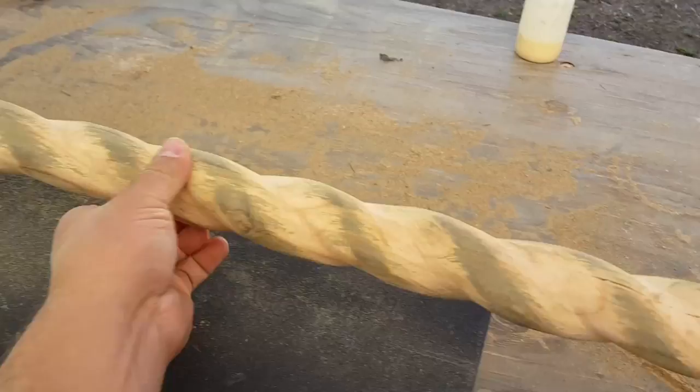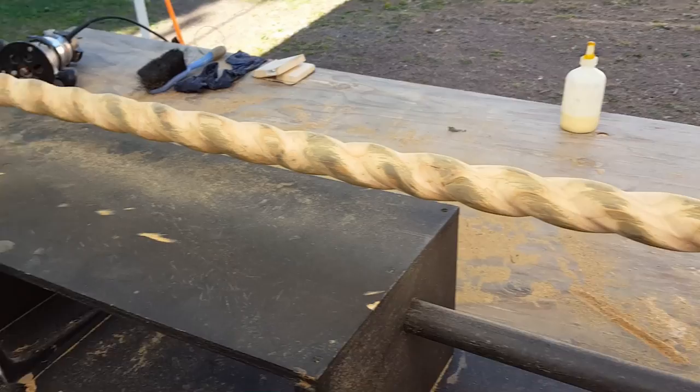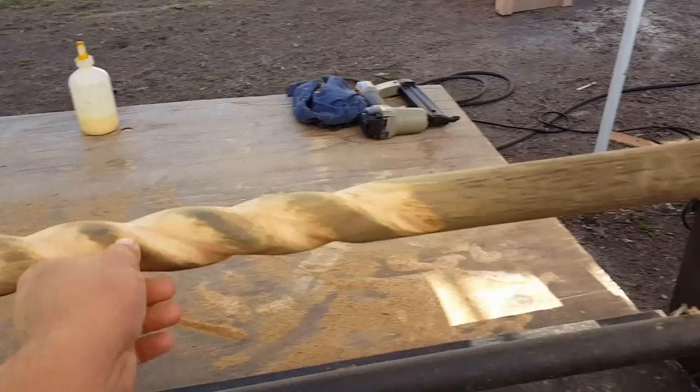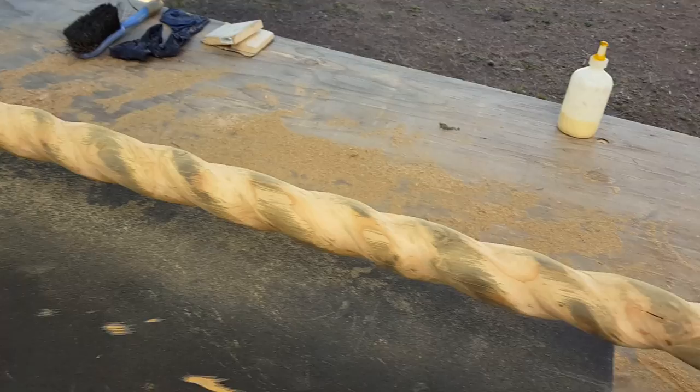This is as good as I'm going to get this one. This is now perfect for if you were doing something like a carousel prop, a barber pole, a walking stick, or anything with this kind of design. But for our purposes, what I'm going to do now is I'm going to take it off of the little mounts there, and then I'm going to set my table saw for exactly half the thickness of this thing and rip it in half. I'm going to be really careful not to spin it as I'm going through the saw. Because of what we're doing, this doesn't have to be exact — if you were trying to make something for a grandfather clock where it had to be real precise, this is probably not going to be the coolest way.